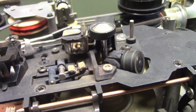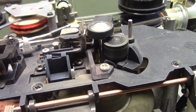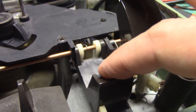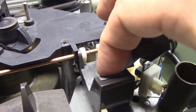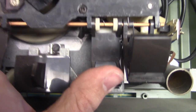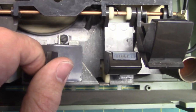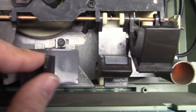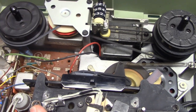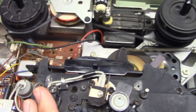One interesting thing about this recorder is the way the pinch roller operates. And then the pause. Rewind — the mechanical part of the rewind is to disengage play mode. If you go into play mode and then go to rewind or fast-forward, it automatically stops it for you. But that's all the mechanical function of this rocking thing over here does. The up-and-down motion is just dictated by the motor being turned on and off, and of course the direction the motor turns.